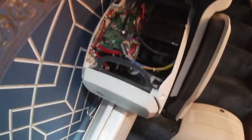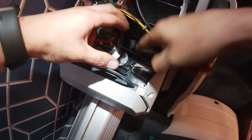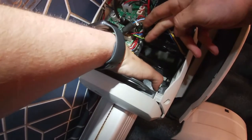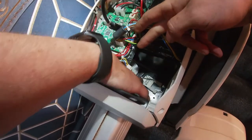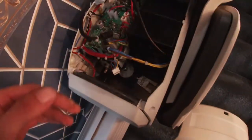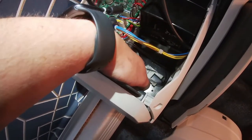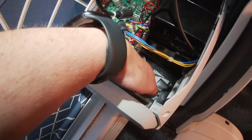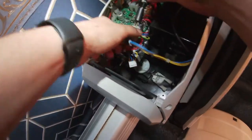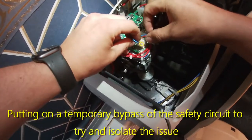Yeah. There we go. I'll basically go with the governor in here. That part here. So it's rotating, it's going up and down stairs, but if it engages fully, it depresses that switch, and that's when you get the stoppage. Okay, so not working, so we'll bypass the footrest temporarily, just to see.